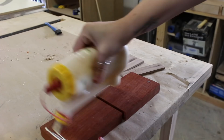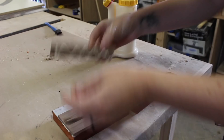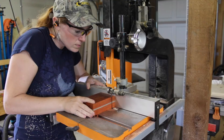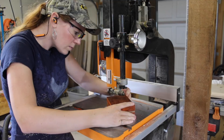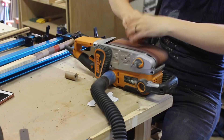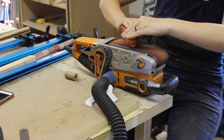While all of the segments were drying, I started working on the handle of the cane, which I decided to make from padauk and a small layer of walnut. I found a cane handle template online, cut it out and traced it on my blank — I'll leave a link to the template in the description. I cut it out at my bandsaw, then spent some time at the spindle sander to clean it up, then moved over to the belt sander to refine the overall shape of the handle, making it much thinner and rounding it over so it fits in the hand nicely.